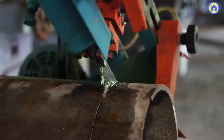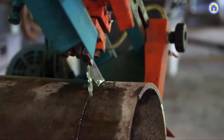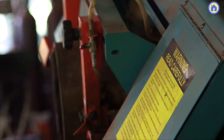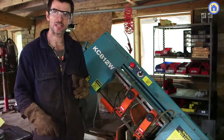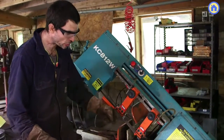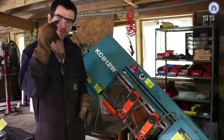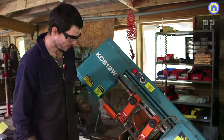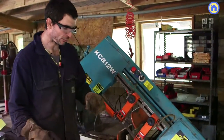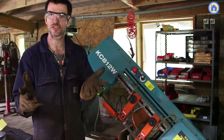Just be careful about safety here — the moving part is the blade. Don't want to get your hands in there; they'll cut right through you. Other safety equipment is, of course, goggles at any time, safety eyewear, because there could be little pieces of material that come off and hit you in an eye. Beyond that, full body clothing I like to have all the time. Gloves for handling metal, which is typically sharp.